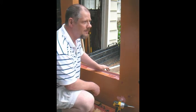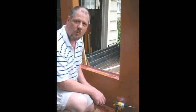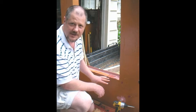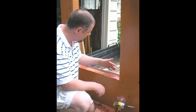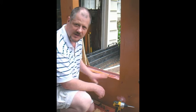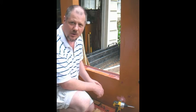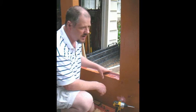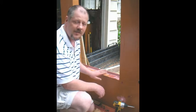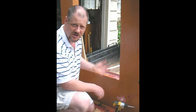The reason you want a backstop is this is a nice way to shed water away from this interface - this horizontal interface where you could have sitting water. If you didn't have this, you have a much higher risk of water going into the assembly or into the interior, as opposed to being shed outwards. If you want to get really fancy, which you might want to do in a high exposure area, you would want this sill to be sloped, canted outwards, so that it was shedding water.